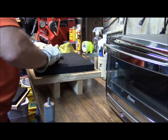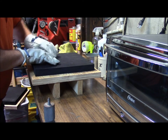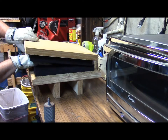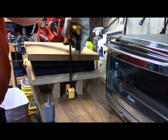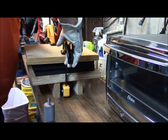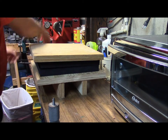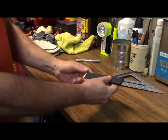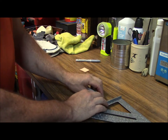After a few minutes, get your Kydex out, put it in your press, line it up to bend — bend baby bend. Put your second half of your press on top and clamp it down. After a few minutes, give it time to cool and set up. Pop your clamps off, take the top of your press off, and now we're folding. After it's cooled down, go ahead and remove your blade and the joint from this side.